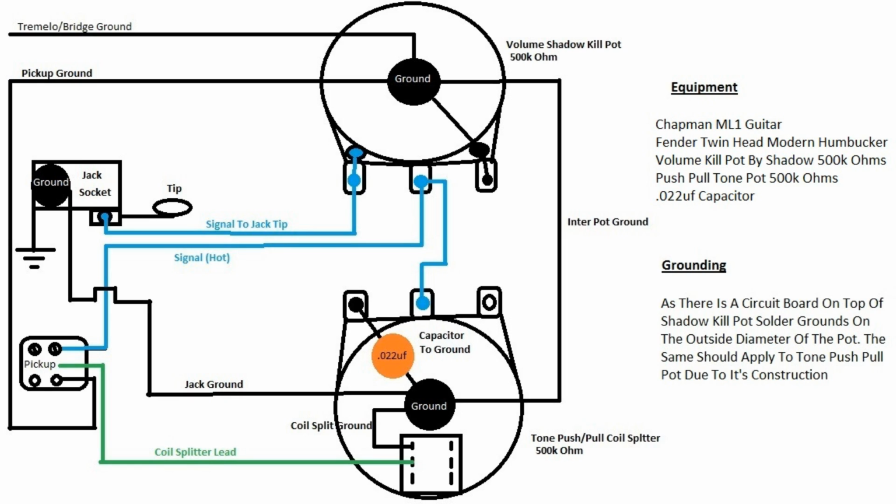And conversely, on the tone pot, when you turn your tone up to number 10, the resistance between the centre connector and the left-hand connector is very high. Now, when it's very high, it means less of the signal is going to go through the capacitor, which is mounted between the left-hand terminal and ground. So therefore you will get more of the higher frequency, or the treble frequency, as we would like to say.